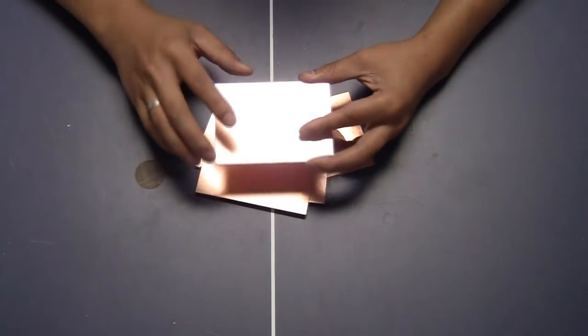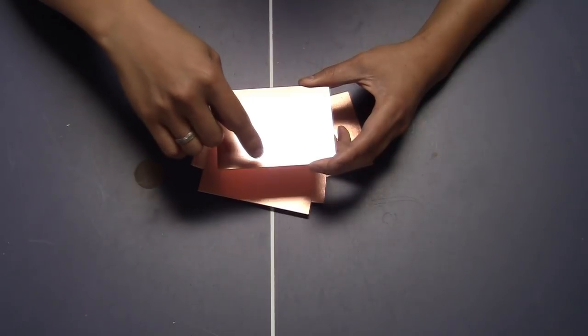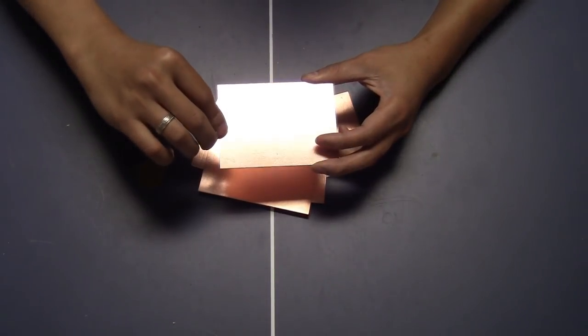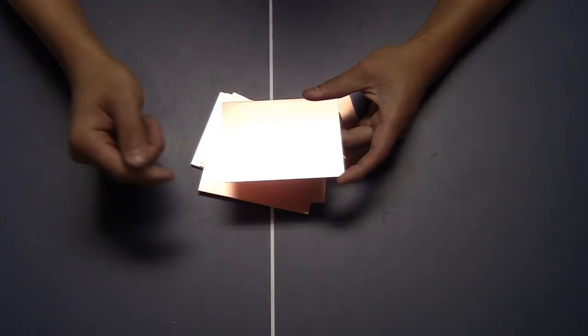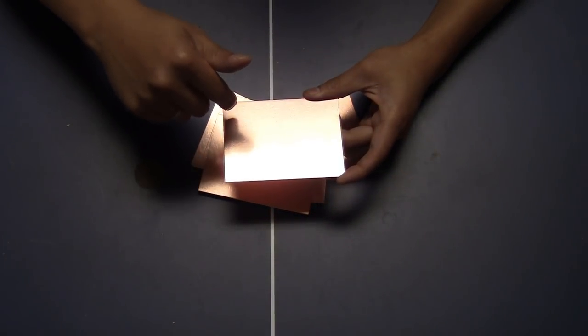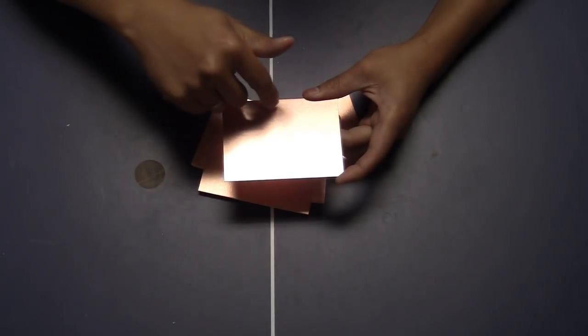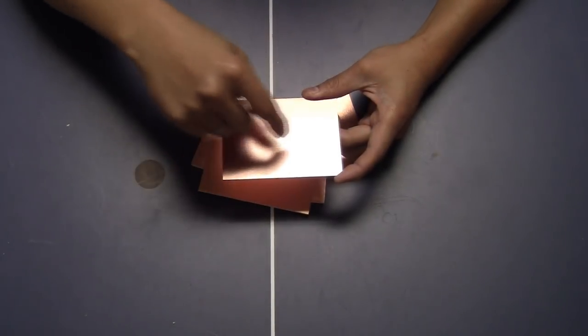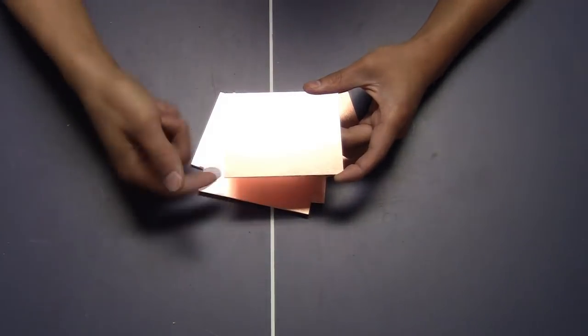And for me, making it on one side is easy. The most difficult thing is when you do double sided, when you flip over to this side, you have to find the exact reference, so when you do all the hole drilling, all the parts and tracks have to be in exactly the same place compared to the other side.